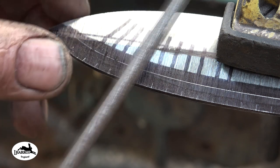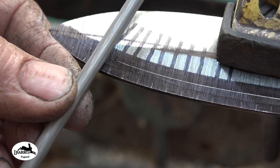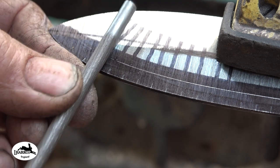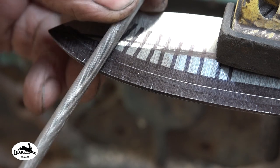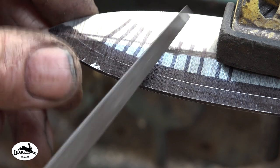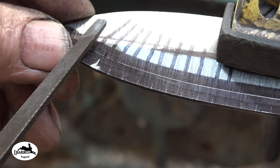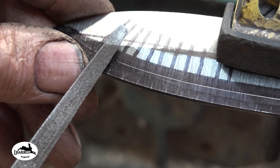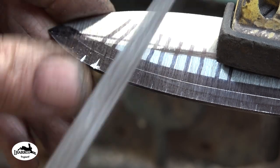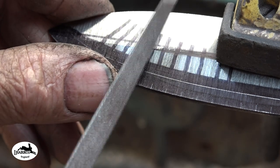As I thought, you are properly in my way. So when I'm on those lines I will get the file and I'll put it right on that center line of that mark. Actually it's a little bit sketchy that. So what I'm going to do is take this triangular file and I'm just going to mark each one of them like that, so that my round file can have something to seat into and then it's not wandering all over the place.